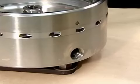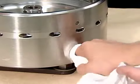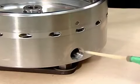When cleaning the insertion parts of the pilot valves, do not use metal utensils or rough sandpaper to clean these parts. Take care not to damage the inner surfaces of the O-rings. Such damage can cause the seals of the O-rings to deteriorate, obstructing the opening and closing of the valves. Be sure to clean using a soft cloth.